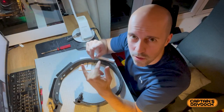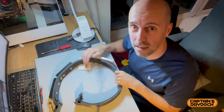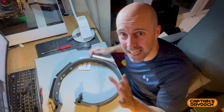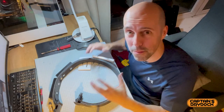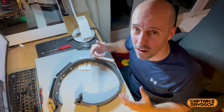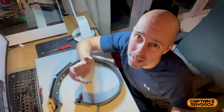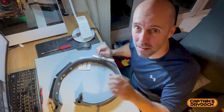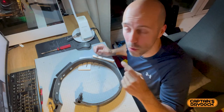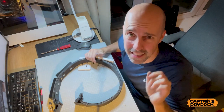About using a soldering iron and drill to make holes through the belt — I don't advise you to do that. Get yourself a hole cutter. It's an absolute pain trying to make a hole big enough, because when you drill or use a soldering iron, the rubber just comes back together again. A hole cutter takes the material away, leaving a nice clean hole to feed through. If you take anything away from this video, get yourself a hole cutter.